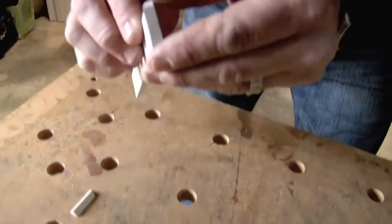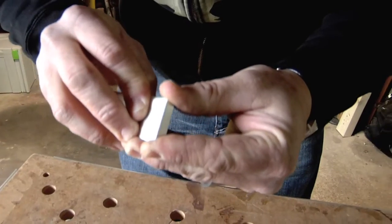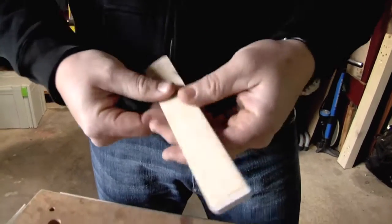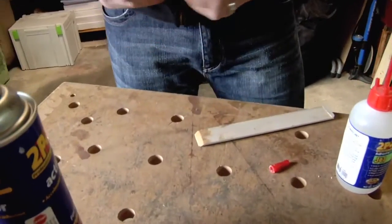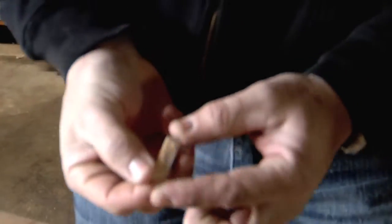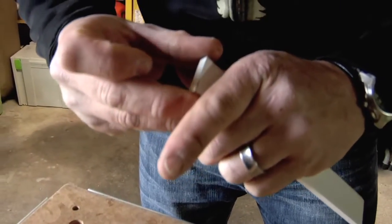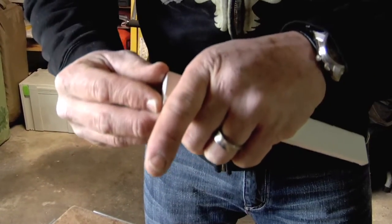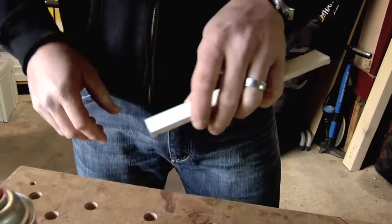Line up the fronts, roll it back. This is a little older, so I do get a little more playtime than if it was brand new. Hold it there — we're done. That return is on there. We can do the other side. Keep it off the face. If it does ooze out, don't wipe it with your finger because you will be stuck. We do have a little ooze out here. One of the ways to clean that up is it is damp right now, so if you spray it with the hardener, it's done and dry.